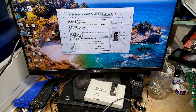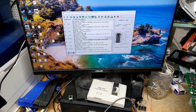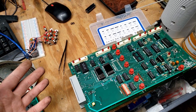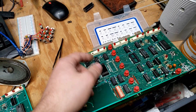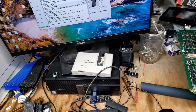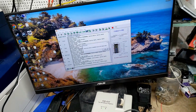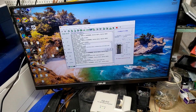Are you fucking kidding me? Could this entire issue have been caused by a bad EEPROM? I decided to back up the EEPROM, so I took this one out, read it, and then decided to compare it against this one — and the verification failed. That's weird. So maybe these chips don't verify properly. I grabbed the dump off of this one and verified it against itself, and it verified correctly.